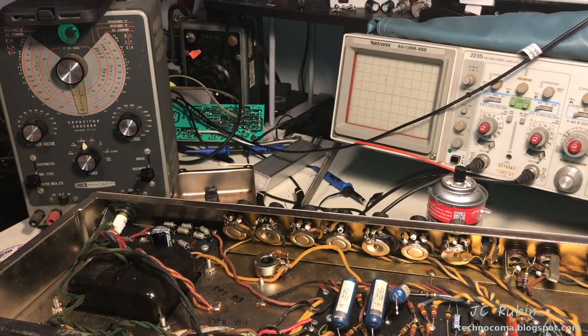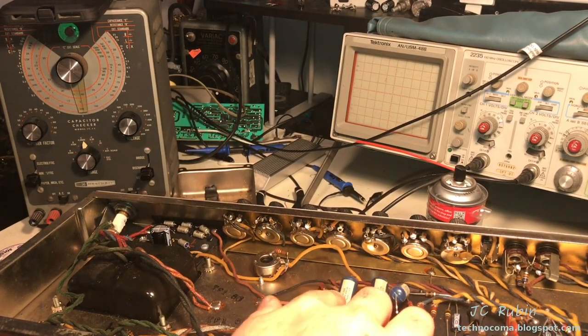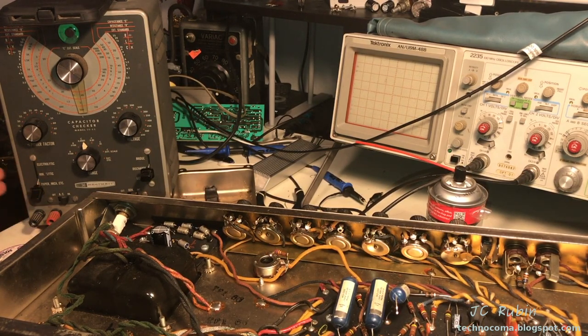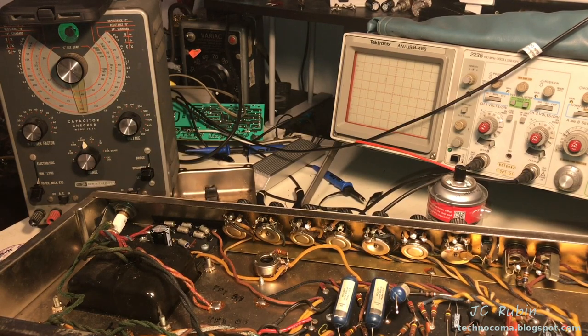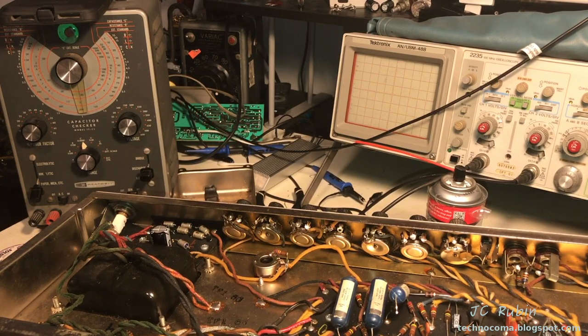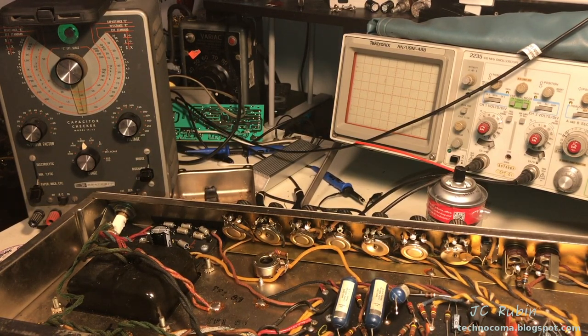This test is going to be a lot less subjective than the electrolytic capacitors. The charge rate is very quick because they have a very tiny capacitance. Also, we're going to be setting this for paper mica. It gives it an almost pass-fail. And we're going to dial up all the way to the rated voltage on these, depending on the cap. I believe we're going to start off with 400 volts, and if it doesn't make it, it's no good. If it does make it, it's good, and that's all there is to it.